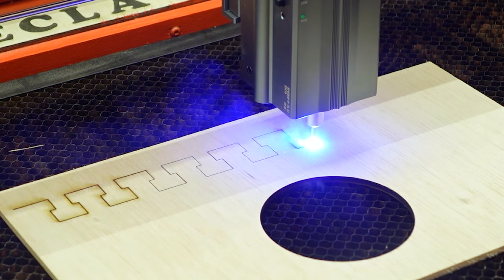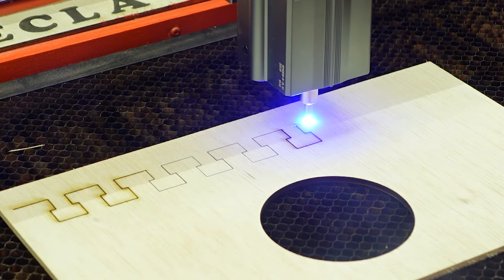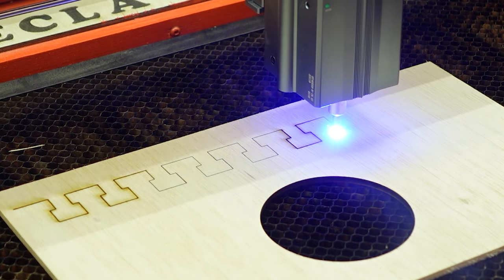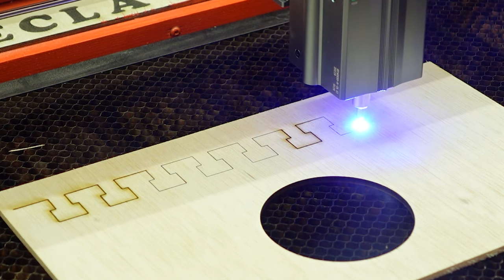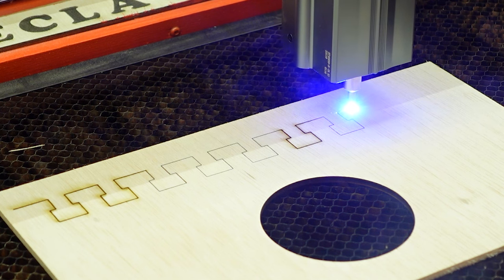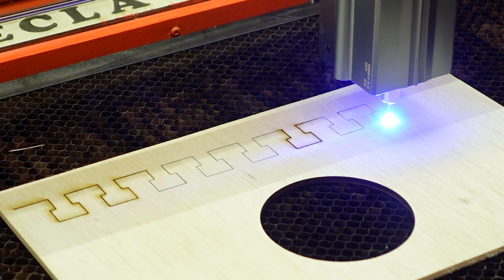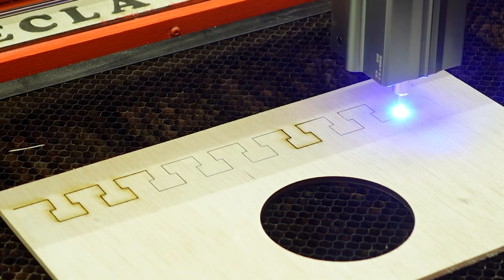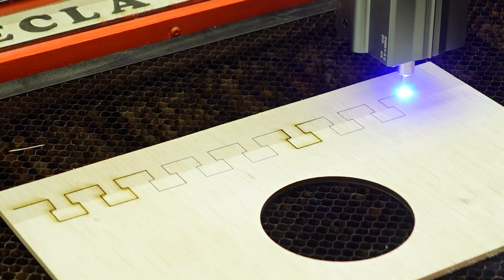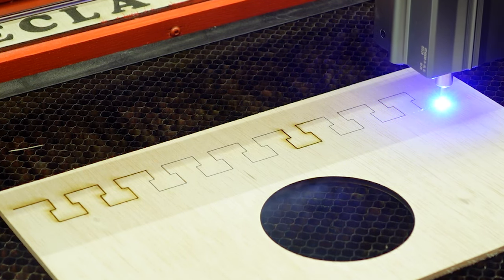That's with the air pressure turned all the way back down — see how dark the line got again? Then I'm going to crank it back up before we run out of test material and try to get it set back like it needs to be. There — that's about where I like it. Now on the gauge it's not even showing any pressure right now, which is exactly why I'm telling you pressure reading is not necessarily what you need to go by.